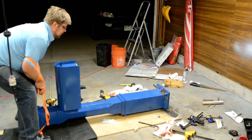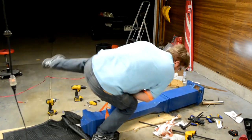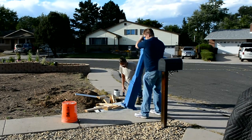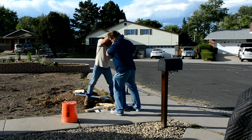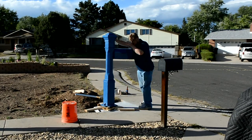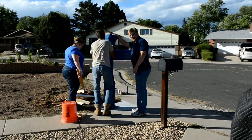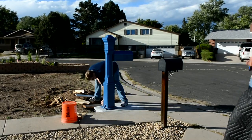This is also dangerous — you could hurt yourself if you fail to lift this thing up correctly. I lost my balance at one point. To get it into place, we piled some scrap wood, raised it up onto that, then rocked it back and forth while removing pieces to get it onto the bolts — and it worked. After it's down, we bolt it in, and then I do a line of silicone around the base so no water will infiltrate underneath and cause it to rust anymore.